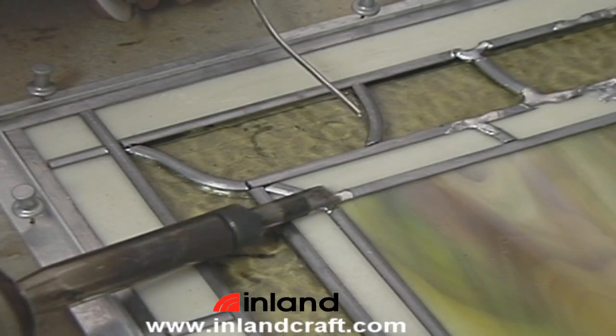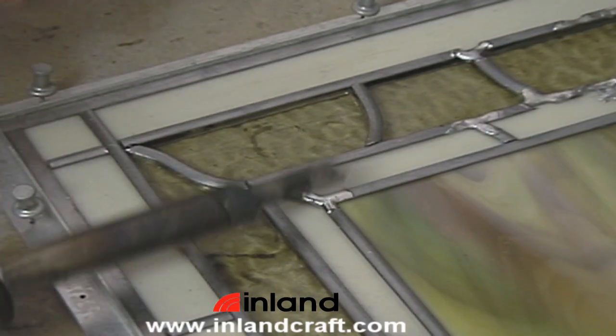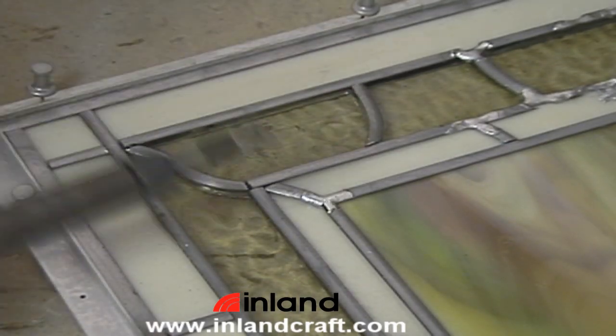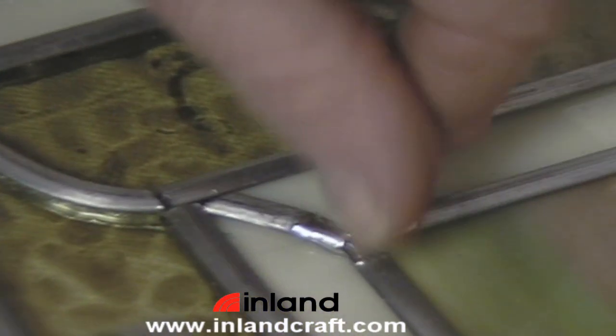Melt a little puddle, give it a little swirl and pull off. You never want to pull up because you'll get little ridges off to the side. You want a nice flat seam — you should be able to pull your fingernail across it and it shouldn't click.